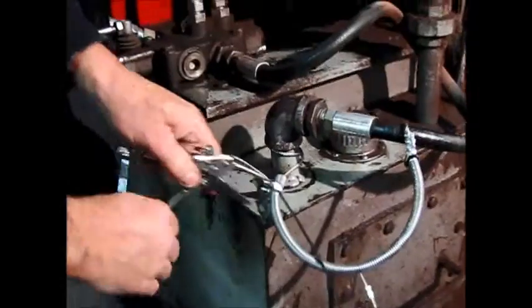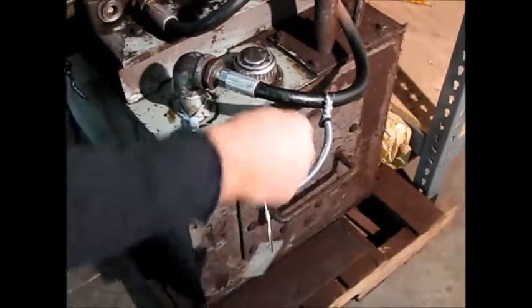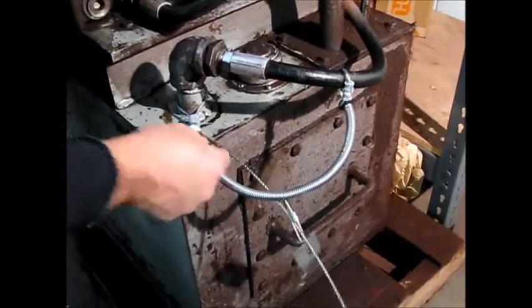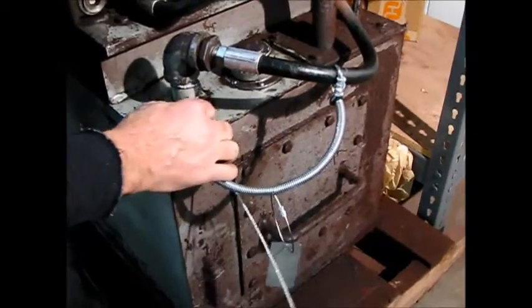Simply take this off. You want to place your cable choker on this 1/2 inch hose. We're going to come in here about 4 inches, and that's all that's required. What I would do if it was me, I would take a pair of dikes or a pair of cable cutters and leave about 1 inch of slack in this. Cut that right there, and that's all you need.